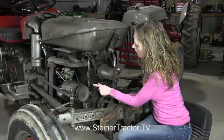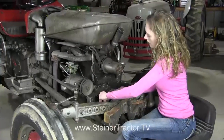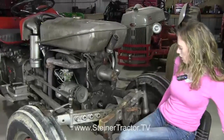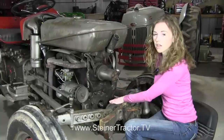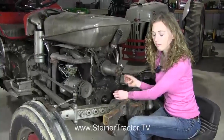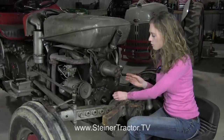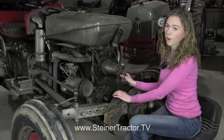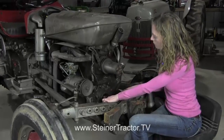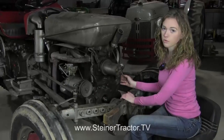You can see there's a linkage back here which will come off as we pull this cover off. This pulley I have loosened up so it will come right off. Then this cover you want to remove. There are a lot of bolts around here and then there are three bolts in the bottom of your oil pan. The oil pan will stay on the tractor, but you need to remove those three bolts so the cover will be freed up. The cover is aluminum so you don't want to pry too hard, and there are a couple of dowels down towards the bottom, so work carefully to get this cover completely removed.